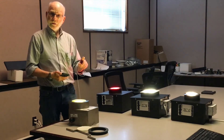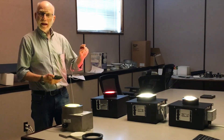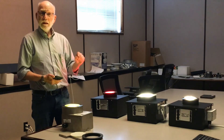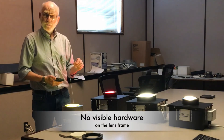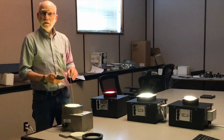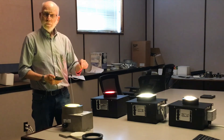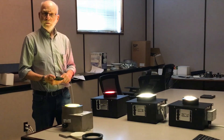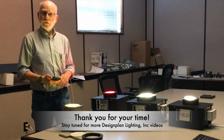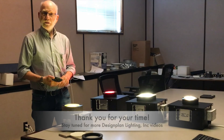No corners yet — we hope to have those later this year. The linear fixture will be extruded aluminum with die cast ends, vandal resistant, with a three-sixteenth inch thick polycarbonate lens. There will be no visible hardware on the lens frame — set screws on the side let you loosen and pivot the lens frame to access the LEDs. It will have a remote driver when used as a steam room fixture. That's our video for today — this is the first in what will become a regular series. Thank you for watching.